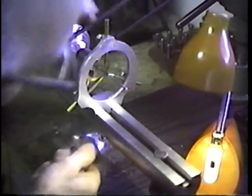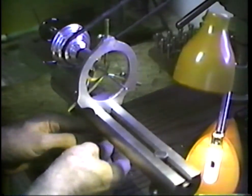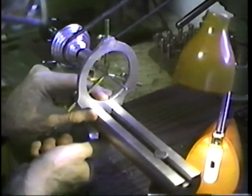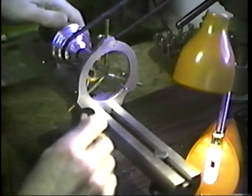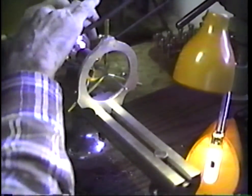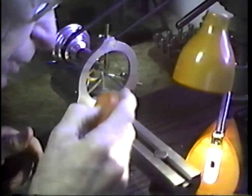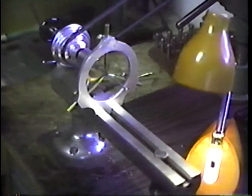Go back on here, and have to get the draw bolt tight in it. Let's select the drawbar, roll this just a little bit. We were in alignment with the lower supports on this, and now we'll let down the top support. We'll drop oil on it, see what we have here. Let's see how much we're off. Take a look,